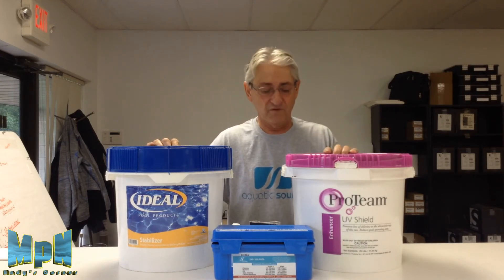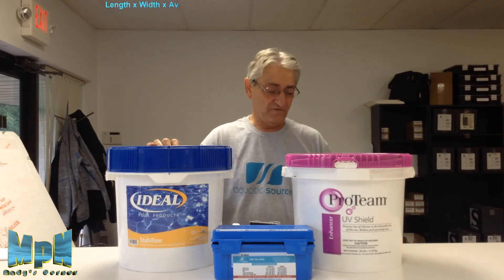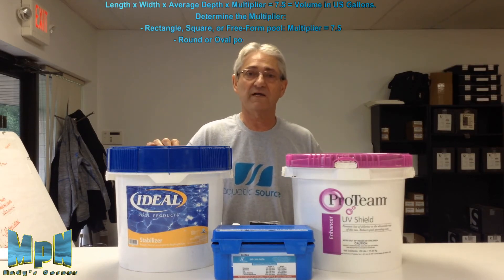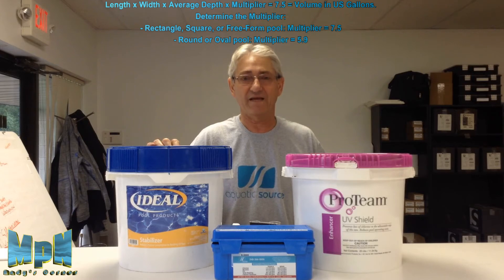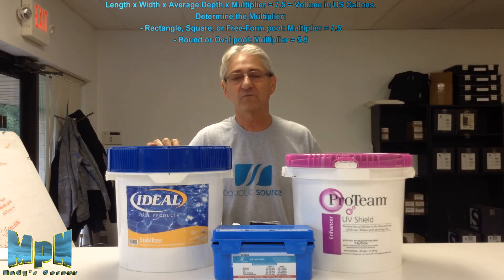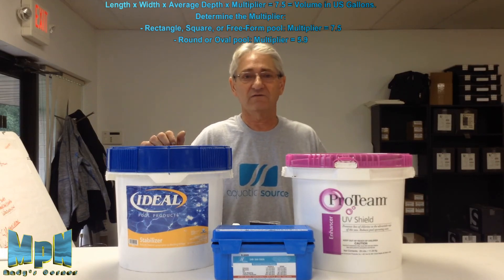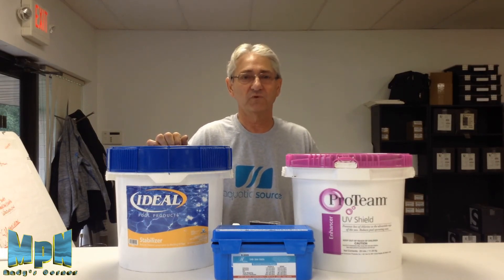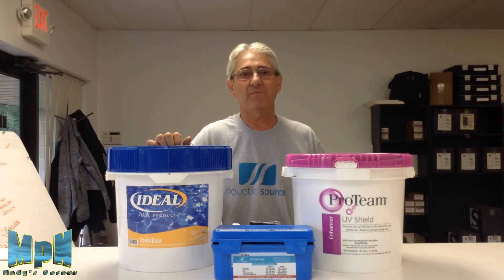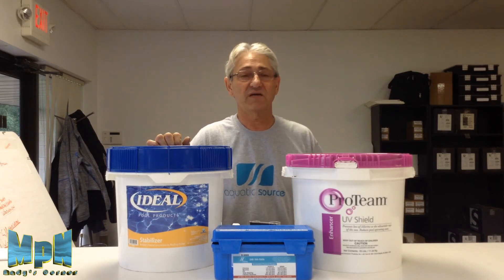The amount needed for the pool is marked on the back of each container as to how much you add. It's roughly 13 ounces to put 10 parts per million in 10,000 gallons of water. You can either pour it into the pool and wait, because it's very slow dissolving — it could take a week or so. Or you can put it in with a pool that has a gutter; you can put it in a nylon bag and hang it in your surge tank so as the water is going by, it slowly dissolves.